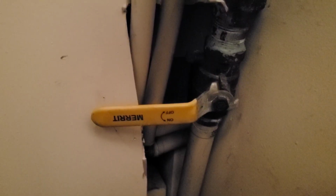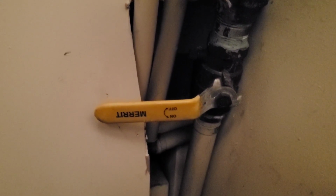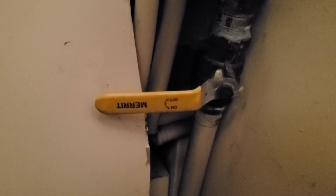Now the stops can be turned on and water run through the faucet. Run water through the faucet until the bubbles subside and you get a nice clean flow of water. Once you have a nice clean flow of water, you can shut off the faucet and then open the water main the rest of the way. To finish opening the valve the rest of the way, make sure that the PRV above the valve is silent so the system is pressurized.